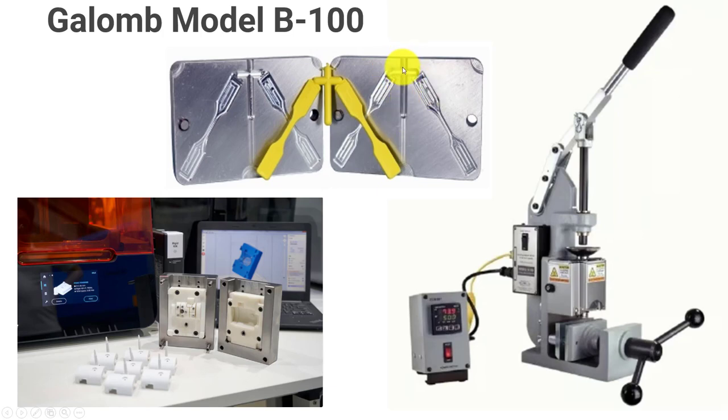This is a cold well, so the first initial plastic will come down in here and get hung up. The rest of the plastic will flow into the cavities filling them up. This is a balanced mold where this gate has the rigging — this little cross or plus sign — that allows the material to go through the runners into the gated areas, and this is the final part.